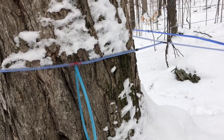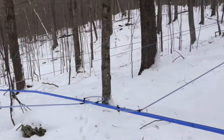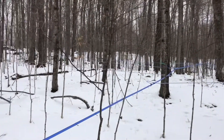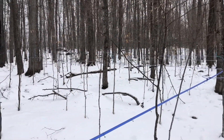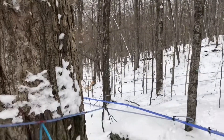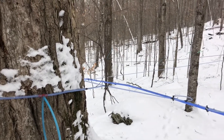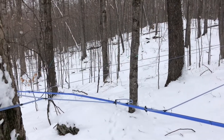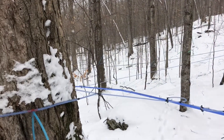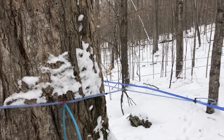Makes a big difference. Now think if you had one of those in your woods when the sap was running, hanging like that — oh my goodness, it's going to do all kinds of crazy things. The sap will be coming in and out of the releaser like crazy, doing a big pulse deal that you see sometimes when there's large leaks. So it's important to get your leaks fixed. I know they're not 100% right this minute, but just trying to build some easy vacuum right now.